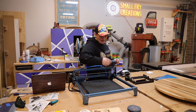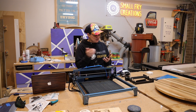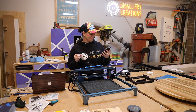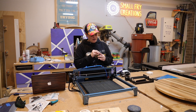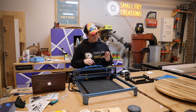Let's stop and take a look at this black acrylic because it has bubbled as it was engraving, which is not what I was expecting. I'm so silly — it has a clear plastic protective sheet that needs to be peeled off. That's why it's bubbled. That would have turned out great if I had taken that off. Really should have looked closer before I did this. Let me take off this clear sheeting, which I should have done to start with, and we'll have another go — because it looks great, it's just not a hundred percent because of the plastic sheeting.